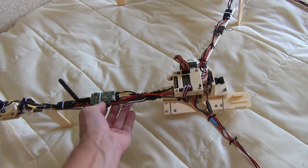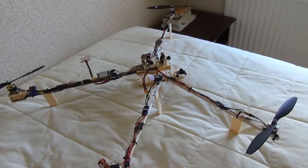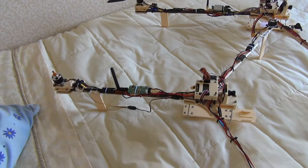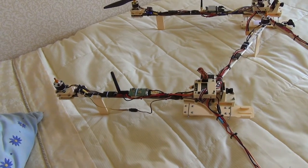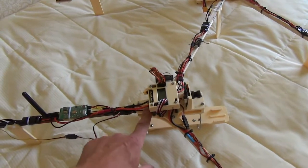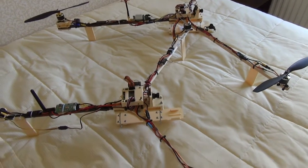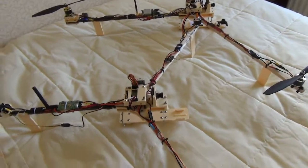The wiring needs to be tidied up a little bit. It's slightly oversize because if this thing turns out to fly rubbish compared to the larger version I can just increase all the boom sizes — not a big job to swap those out. Ideally I'd like the wooden boom on the rear but I don't have time to test that now, so I'm sticking with what I know works — the carbon one. With PLA, you tighten it up and then the next day it kind of pulls through; the nuts and bolts all soften and you have to retighten everything.